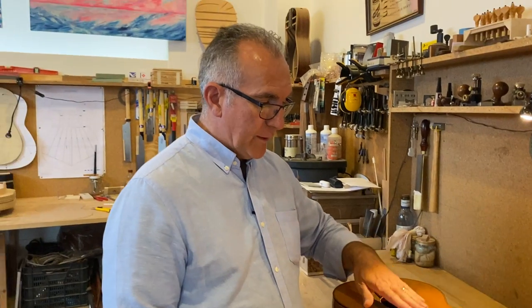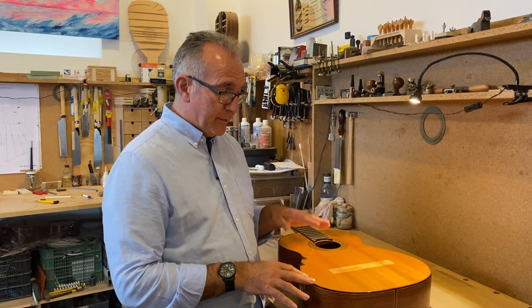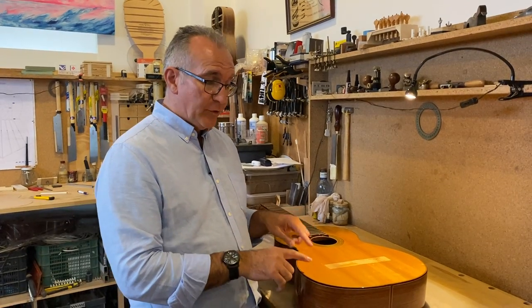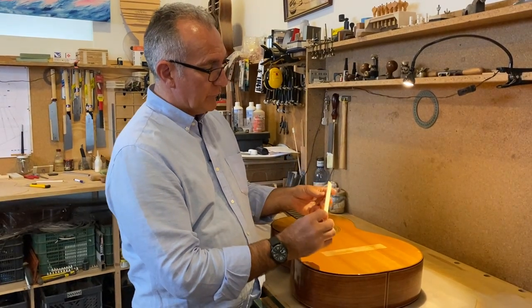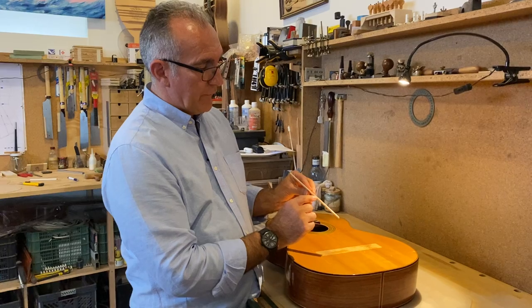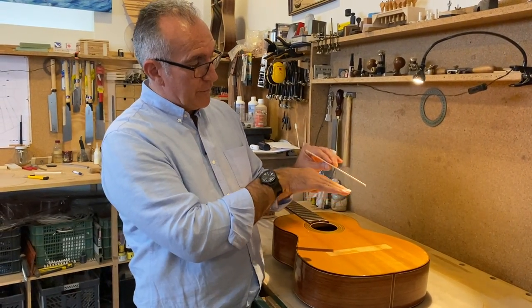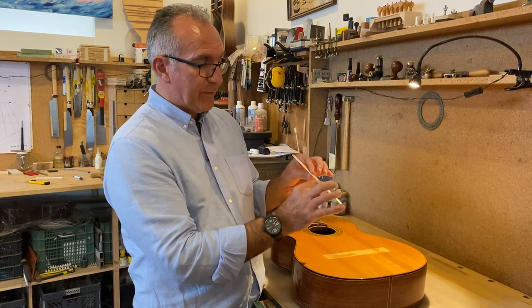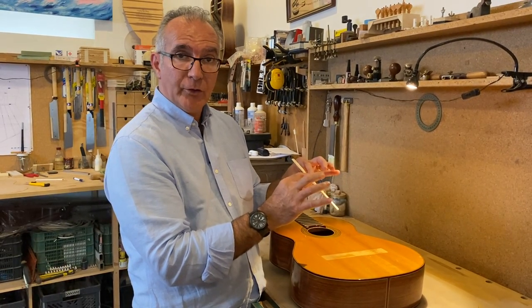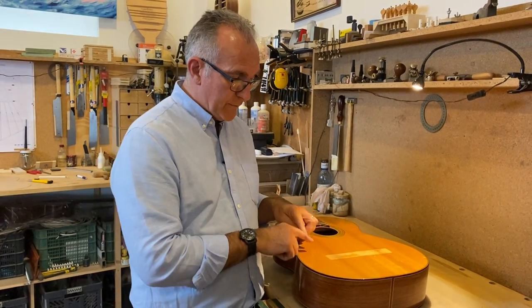One problem is that when it comes to tidying up the final surface it would be quite difficult to make it look good. More importantly, the soundboard is quite thin — about 2.5 millimeters thick — and if you don't bring the two sides level together, you don't have as much surface in contact as you could have, so it's not going to be as structurally sound as it could be.